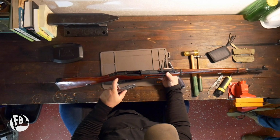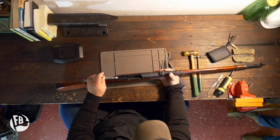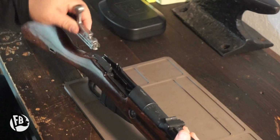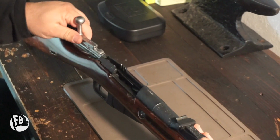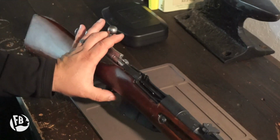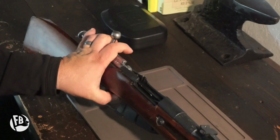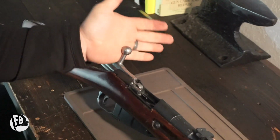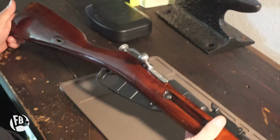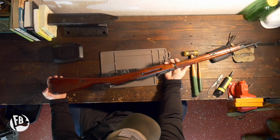We're going to make sure that the bolt handle, the knob, is up, and that the lug here is lined up along here. If you try to go this way, obviously it's kind of common sense, but it's not going to be let in until you pull the trigger down. So you try to put it in, grab the trigger right here, pull back, and that bolt's going to slide right in. Okay, and you're locked in. And that is the disassembly and assembly of the Mosin Nagant.